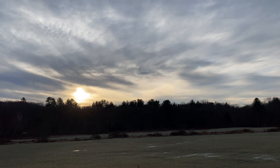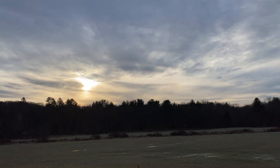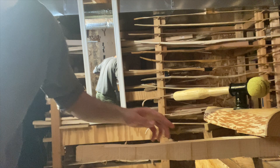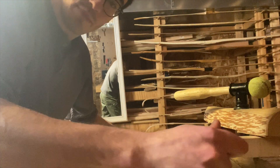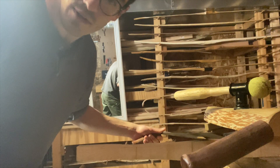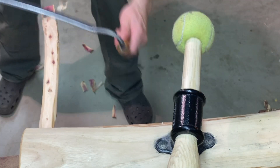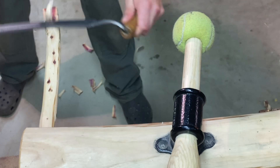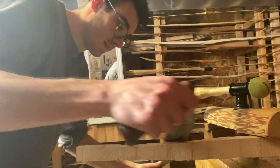Tip number six: for keeping your knife sharp and avoiding chips in the blade, try not to bang your knife against the cut. If you're having trouble, try to split it up into smaller increments. Here we have a little knot — you could keep banging but you're just going to chip up your draw knife and not really get anywhere. Find the biggest cut that's still easy and do the whole thing in smaller increments.